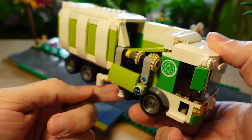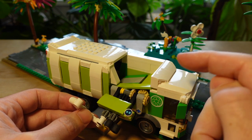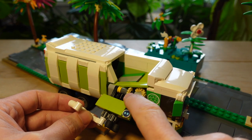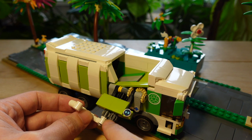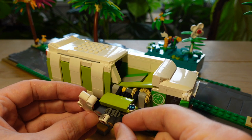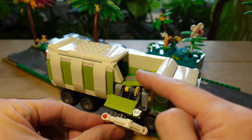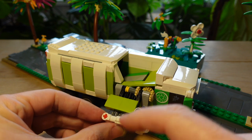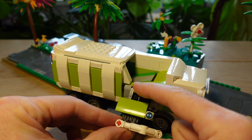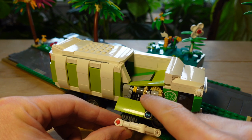Let's talk about this genius little mechanism. It's essentially a dual action mechanism with a single input. You have a turning knob on an axle that drives two 90-degree gears, which then drives two more 90-degree gears. On an axle down here, these two gears are matched together to open and close the grabbing mechanism. What ends up happening is that when the mechanism is fully clamped closed, they are opposing each other — they essentially lock up the whole mechanism and prevent anything from turning. When these two are jammed together, these two little gears in here can't turn, which locks up those two gears, and that axle gets locked up and therefore this gear gets locked up.